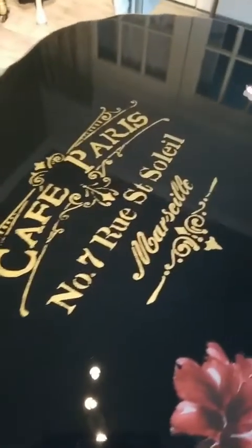And they'll continue to rise for the next 15 minutes after your pour. So I just kind of stay in here, and you don't want to keep your heat gun in one spot for too long. You don't want to burn your epoxy. That'll mess up your curing.